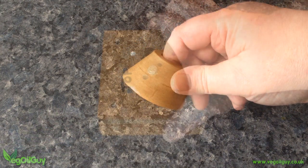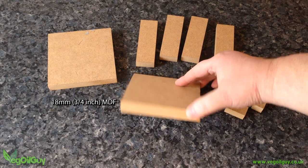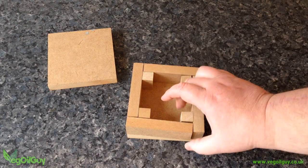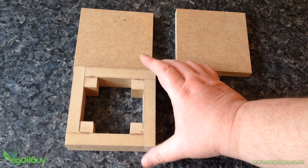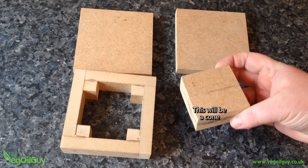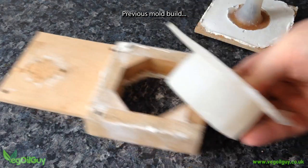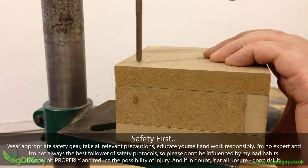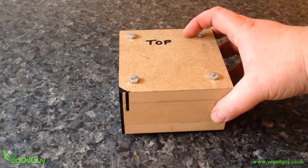For this shape we'll need to make a cone pattern along with a silicone mould, and the mould starts with a simple box. I used MDF as I had plenty of scraps lying around and it's easy to work with. The top and bottom are 5 inches square and the sides are 5 inches less the thickness of the MDF. The height of the sides is twice the thickness of the MDF. I've also got some small scraps for the corner supports. The sides and corner supports are glued together with good waterproof glue. At the same time I glued up some more scraps to form the cone — for now it just needs to be a square about 3 inches wide and the depth of two thicknesses of MDF. I want the silicone to stay inside the mould box, so this time I added a couple of small wooden sections to help grip the silicone. The top and bottom of the mould box need to be fixed with bolts, so I carefully drill four corner holes. To help with future alignment, a marker pen is used to add witness marks.